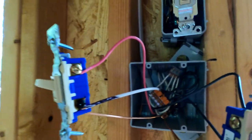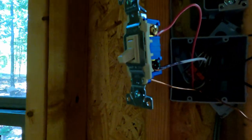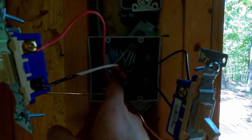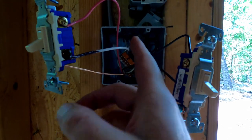There's the final result. This will be our switch for the fan with the red, and this will be our switch for the lights with the black. We've got power coming in off our Wago, jumpered it off — hot coming here, hot coming here, hot going up there. So all three switches are hot. Because this is a 14-3 wire at 14-gauge, it's way easier to work with. That interior stuff — if I'd have known, I probably would have paid extra for it instead of that underground water-rated stuff. It just peels right off, easy to bend, fits right into the switches. Great stuff. Let me get this buttoned up and see what else we've got left.